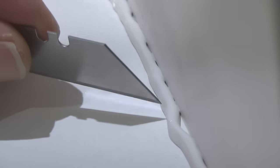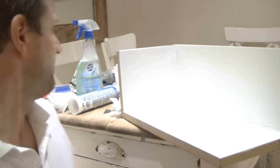But you've also got these gaps all the way along the bead of silicone. Now, typically when I've produced a bead of silicone in the past, I've taken my finger or a forming tool and smoothed it almost straight away. And in this situation, you're going to be closing off most of those gaps, so you've not really got too much of a problem. Although I'll be showing you later on in the video a much better way to apply the silicone into that joint, such that you don't get those gaps.